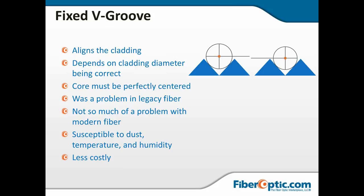The fixed V groove also counts on the fact that you're using a fiber where the core is perfectly centered. Some of the old legacy fiber, pre-97 manufacture, some of it was being hung into the mid-2000s, had pretty loose tolerances on core concentricity, on ovality, and even the core size. It was a little looser. Contemporary modern fibers, it's not so much of a problem. They tightened up on all the core geometry